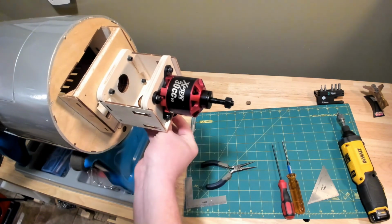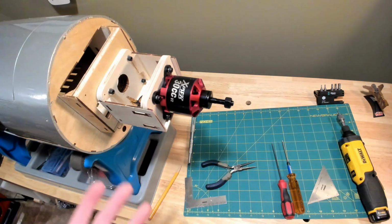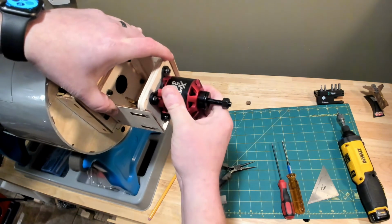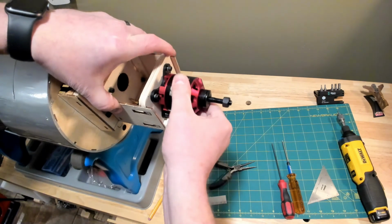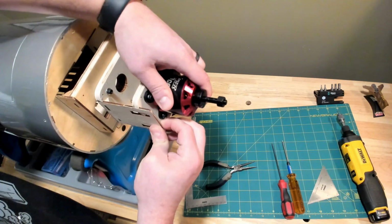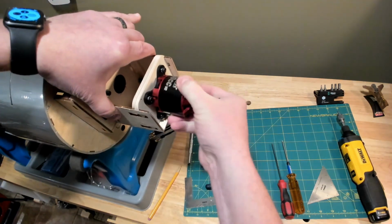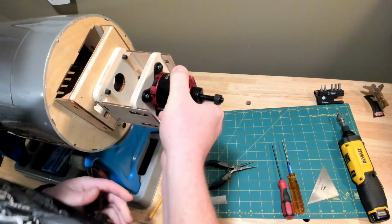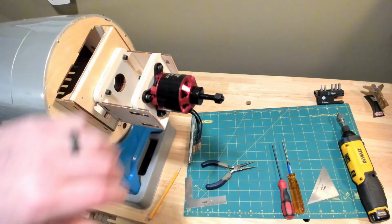So I'm planning to take the motor off again, whether or not it's to put some spacers behind it, and actually with good reason, because I mentioned I put those wires on the bottom, and right now on camera, I'm like, all right, this should be moving. Why is this getting stuck here? I wanted to show this whole plate moving forward and backwards. And I'm just now realizing that, oh, it's because of the way the wires come out of the bottom of the motor. It's hitting the bottom of that whole sub-assembly. And I'm just realizing it right now. And I'm like, oh, it's these wires here.